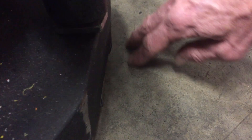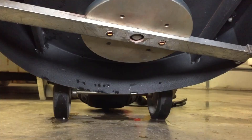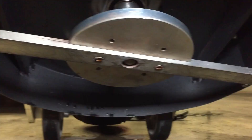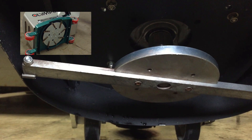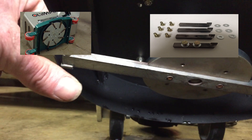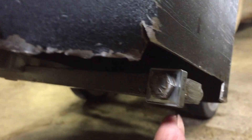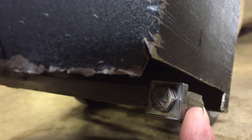This is the bar that the two blades attach to — one right here and one right here. Not all edgers look like this. Some edgers have a round disc — a big round disc — like the Zamboni and Olympia ones, with about eight blades around, each about as long as my finger with a sharp edge. I can't talk too much about those because we don't have one. But this Thompson ice edger has two opposing blades on either side of this blade bar, and they kind of oppose each other as they spin. This blade actually has multiple edges on it — you're able to spin it to different edges, and then flip it over and use the other four edges.